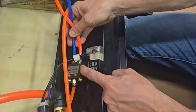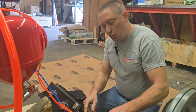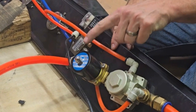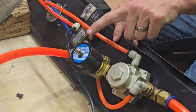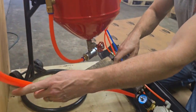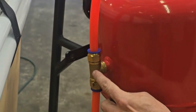We've got our air pressure regulator here. Pressure comes out of this air pressure regulator and goes into an electromagnetic valve. Assuming that valve is in the open position, air comes out of that valve and goes into this PEX line, which comes around to the backside of the pressure pot and goes into a T.